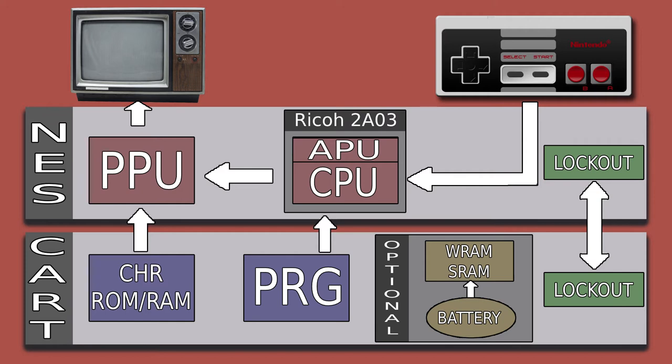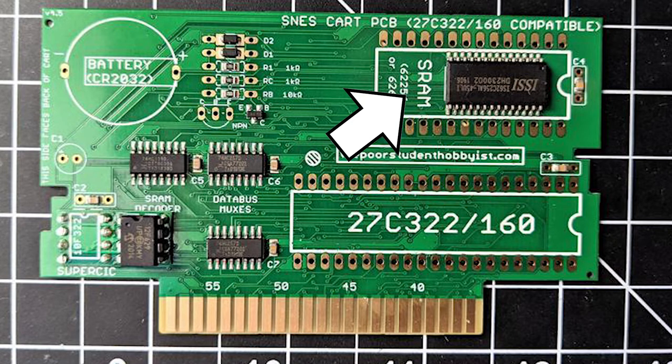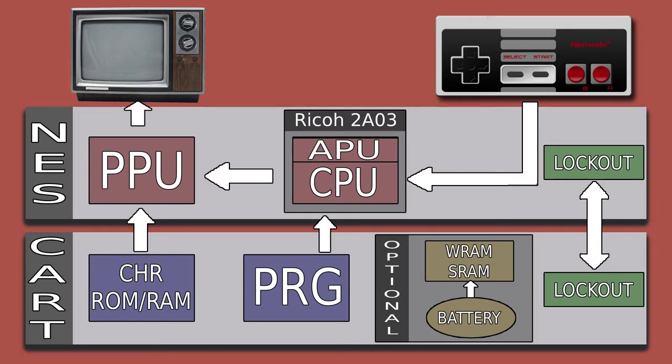On the optional part you have WRAM, which means Workable RAM — some cartridges can have extra RAM. On the right you see SRAM, which means Static RAM. Static RAM is a form of RAM made by transistors; it is faster and consumes less electricity than dynamic RAM, which is composed of capacitors that need to be refreshed. So SRAM is ideal here. On a NES cartridge PCB you may see SRAM labeled — in reality both WRAM and SRAM are types of workable RAM. Some cartridge PCBs include this optional workable RAM and some don't.